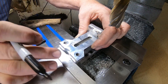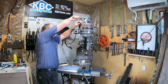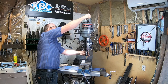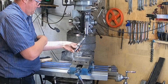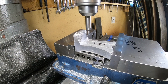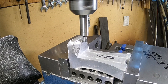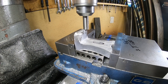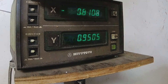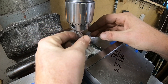Let's grab that roller plate and mark out roughly where we're gonna have the holes. Keep in mind this is going to slide up and down, so we have to give it about three quarters of an inch to an inch of travel. That way if a shaft is bigger on one side or smaller on the other, this will allow us to move one side up or the other side down so it can be perfectly horizontal. I'm going to find the edge, zero it, bring it up to 950 thou, stop there, zero it — and that's where we're gonna drill our hole.